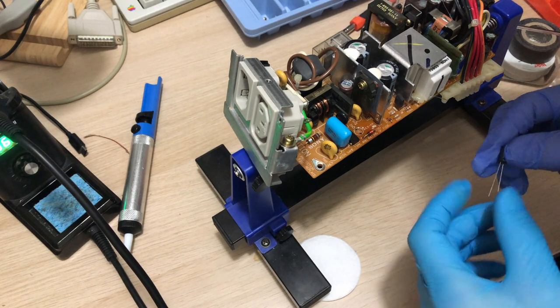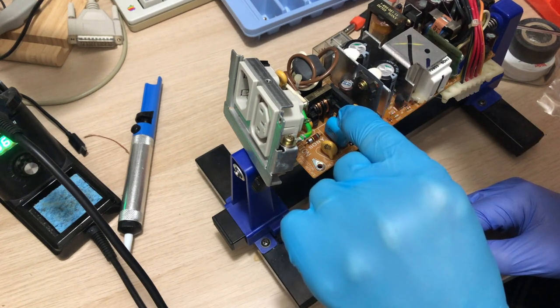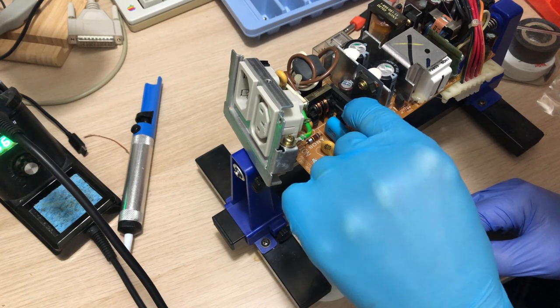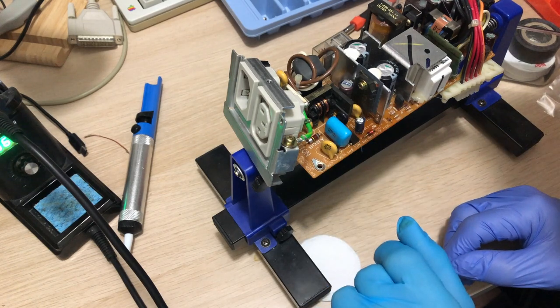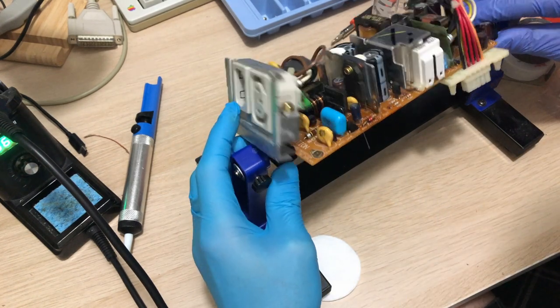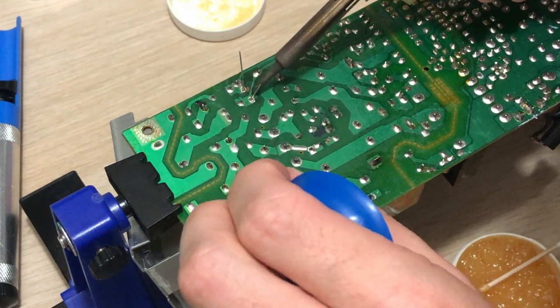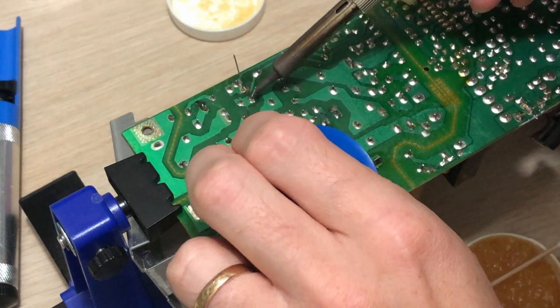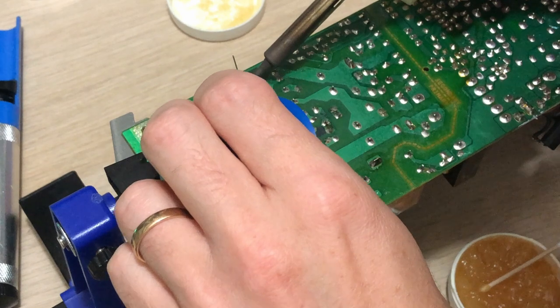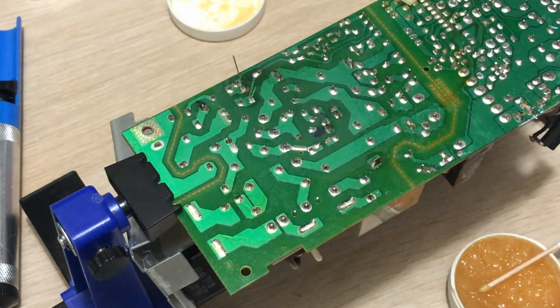There's a great feeling dropping a fresh cap into an old PCB — I just have to get the polarity right. The long leg is the plus, and negative is marked on the side of the cap and also on the board itself. I pop it in and then solder on the back. I use flux paste for heat transfer, put it next to the board by the legs. I'm using lead-free solder, which is probably not ideal, but it does work — just melts at higher temperatures.